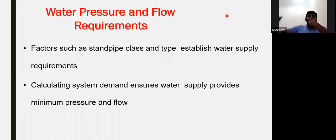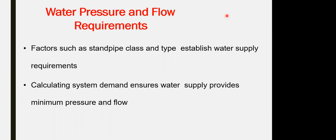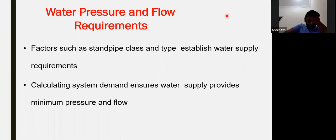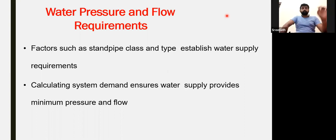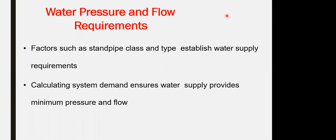At the level of detail for the drawing, for the civil defense approval submission, design, or even as-built, I have to show the tag number for the sprinklers reflected on the schematic diagram. You will also be asked for the distance in the schematic. If he gives you a classification of ordinary, low hazard or high hazard, you can make a distance. The more information you show, the more confidence you give the person reviewing your answers that you understand.